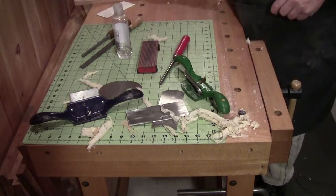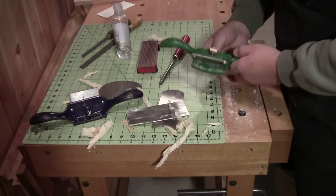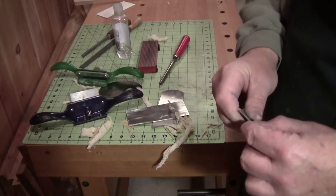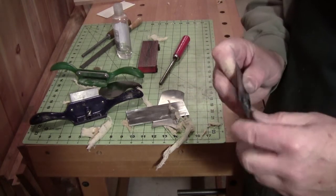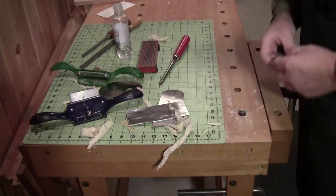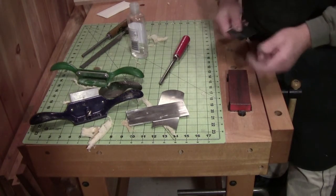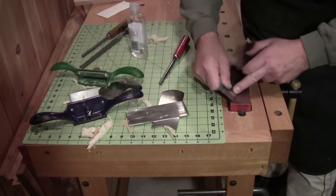So, sharpening them is a little different. The scraper blade, while similar, is different in so much as you have a 45-degree bevel instead of square. The burnishing is the same, but you only get one edge. So, similar process, sharpening stone. Little less difficult because it's behaving more like a 45-degree chisel. You basically sharpen it. Can you do this with a file?